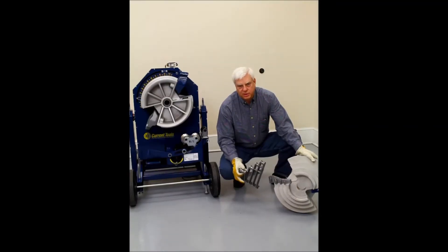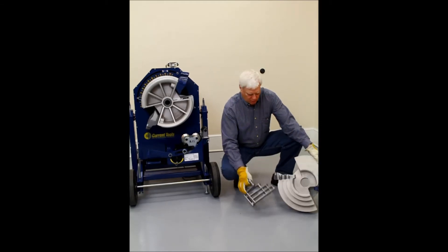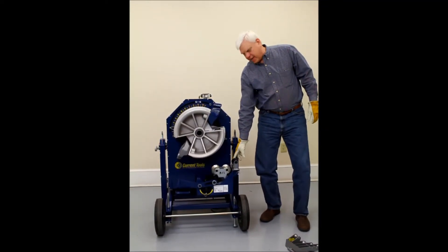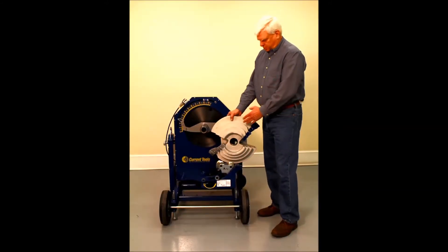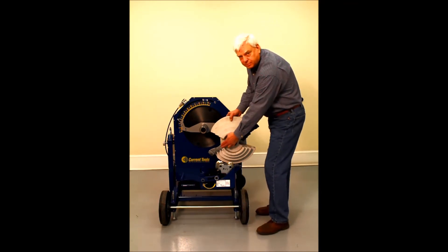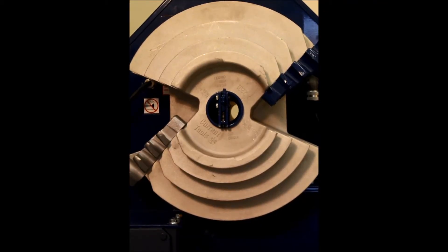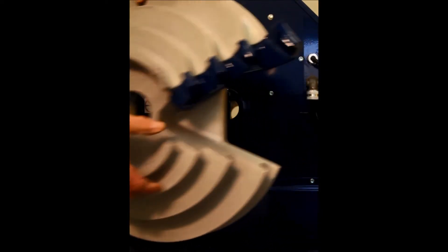The small shoe is used in conjunction with the small roller support, which handles half, three-quarter, one, and one-and-a-quarter inch. The large shoe — inch and a half and two inch — is used with the inch and a half and two inch urethane roller support. On the shoes, the hooks are color coded: the blue hook is for rigid and IMC, and the silver hook is for EMT. If the shoe you've chosen is on the storage tube on the back of the bender, simply pull down on the pawl to remove the shoe and pull it straight off. You can store the shoe you're not using on the storage tube.